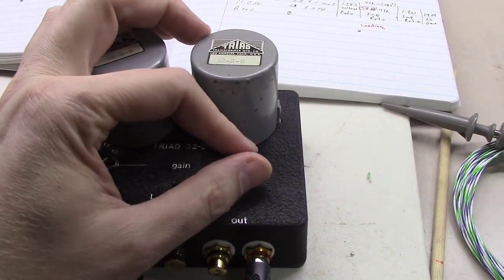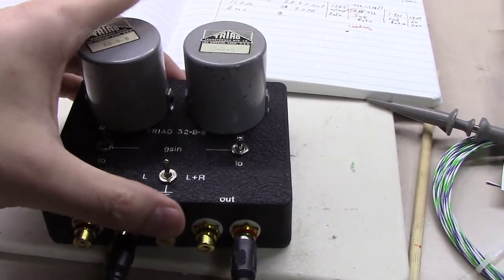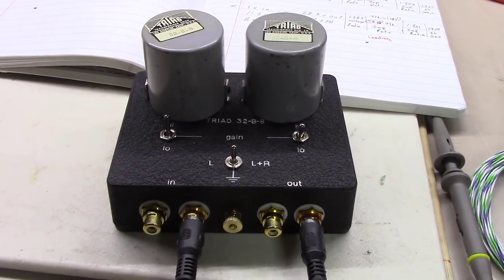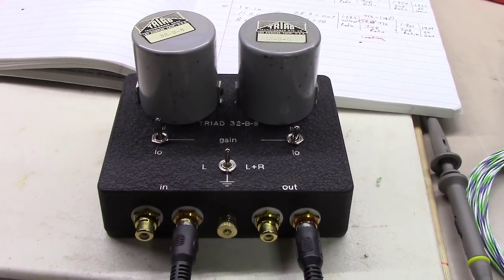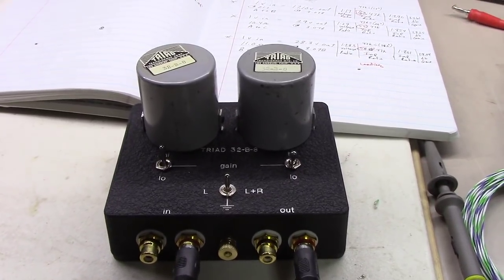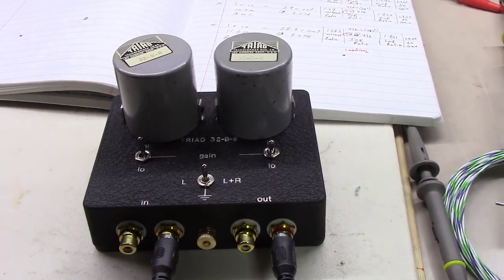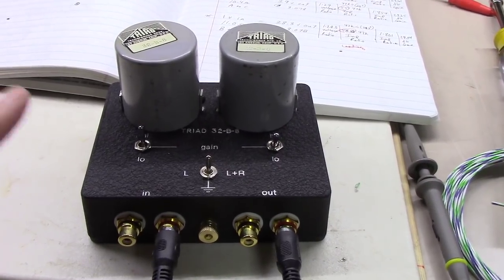You can see the little flip switch going from high to low — really just happy with how this turned out overall. Got the bottom back on, it looks solid. The moving coil cartridge I had in-house has a cantilever issue, so I've ordered a new one — I chose the Hana EL, getting it from Gene Rubin Audio, hopefully as my Christmas present. When it arrives I'll make another video, but you get the idea of how to put one together. You've gone through the steps from beginning to end, and if you ever find an unknown transformer on old gear you can figure out if it's suitable as an SUT. Thanks for watching everybody — hopefully by the holidays we'll be listening to this thing!